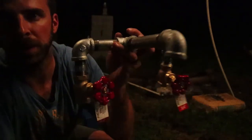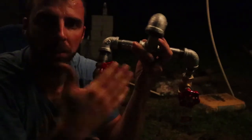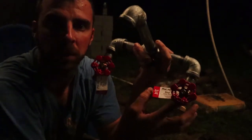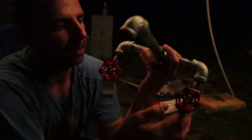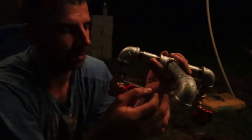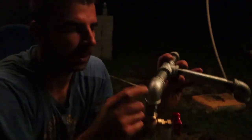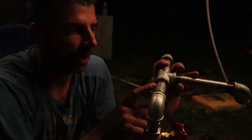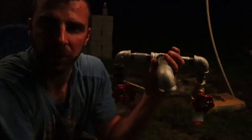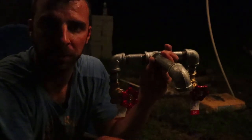I'm building my own mixer valve. Basically one of these is going to be cold and one is the hot. It would have been really nice if I would have found a blue one at Lowe's — unfortunately they only had red — but maybe in the future I can replace the handle so one is blue and one is red. These pieces can get kind of expensive: the elbows are about $2 a piece, and two to four dollars for the longer nipples. This whole thing was probably about $25 — not terrible compared to buying a faucet, where you'd easily pay $25 anyway.